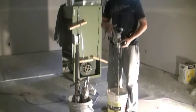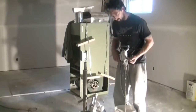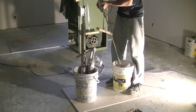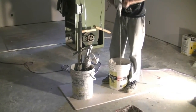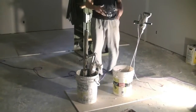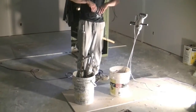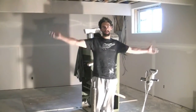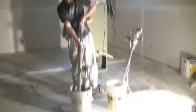What I do is I like to break up the mud just a little bit before I add the water to it. It's going to be a little loud. It breaks it up so that the water mixes better afterwards — it flows into the mud a little bit better. If you start with a new box and you don't break it up before you add the water, the mud is going to spin around and the water is going to come out and you're going to get messy and your work area is going to get messy.